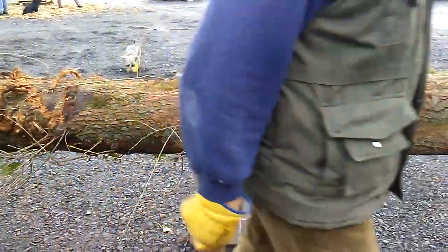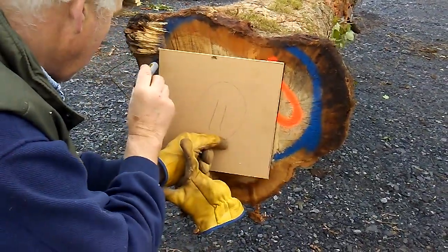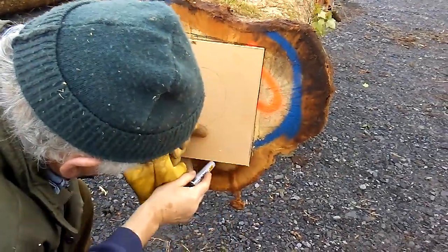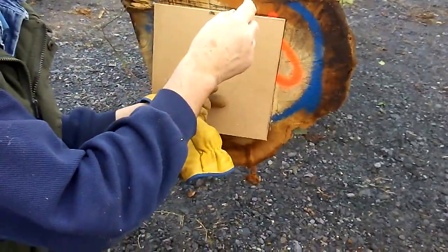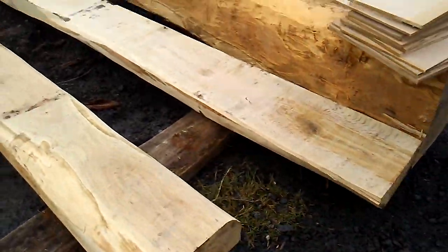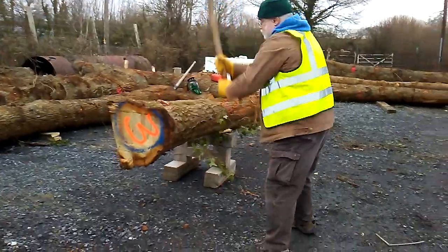It's just a sort of safety. So we're inside the sapwood. Sapwood is the inner piece, or is that the outer? Sapwood is the different color. We want to be in its inside color, in this case the heartwood. Darker color because it's wet. Oh, okay. But in actual fact, when you strip it off, it'll be lighter. You see it? Well, the sapwood is partly gone off. Yeah, mostly gone here. The reason we're getting rid of the sapwood is it has no real strength, relatively speaking.